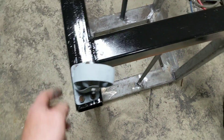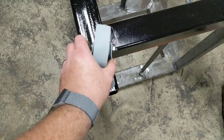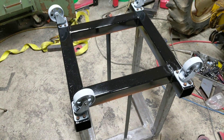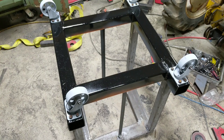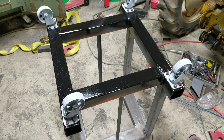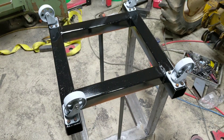You can see the back wheels don't rotate as casters, but the front wheels do — they spin freely. The back wheels being fixed should give us some steering, because we are going to have 750 pounds on this cart, probably a little more once you weigh the cart itself and add all the drawers. It'll be quite heavy, but the casters can handle it — they're made to lift engines.